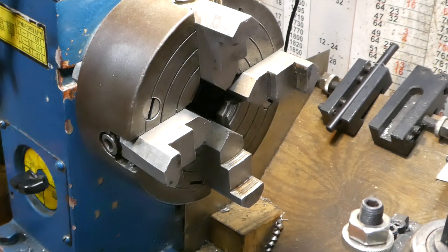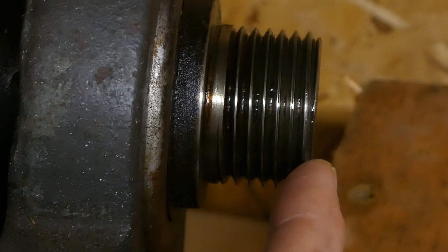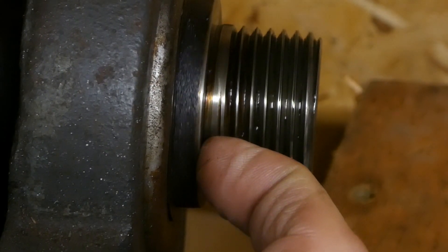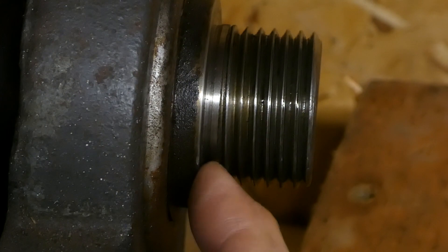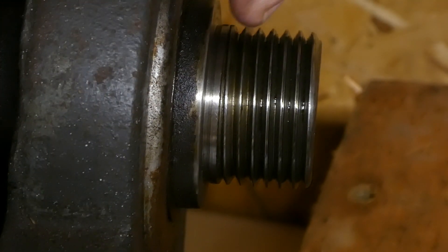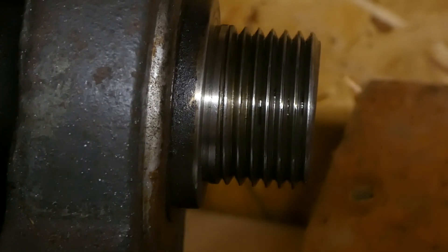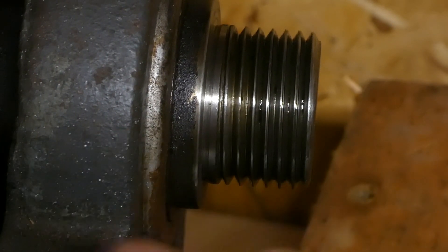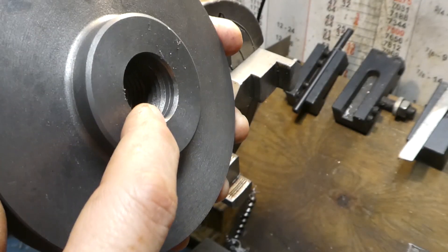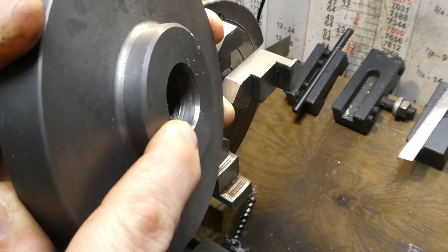This is part of Eddie's customer service - I fix my own mistakes. So if you're not familiar with how these screw-on chucks work, I'll use this 10-inch Atlas as an example. We have our threads, a flat reference area right here, and then the flat shoulder on the spindle. The important bit is this reference below the threads - that makes sure that the screw-on adapter is concentric and in line with the spindle. What I need to do is assume that this center is cut properly and make all our reference off of this flat section in the adapter nose.